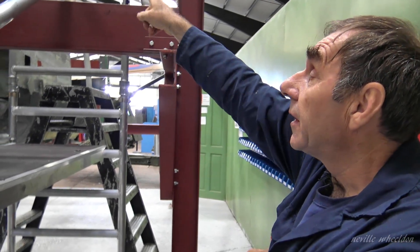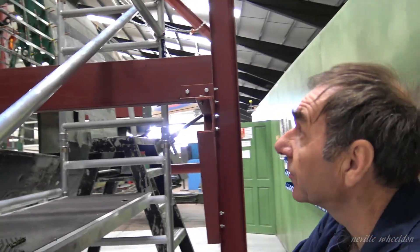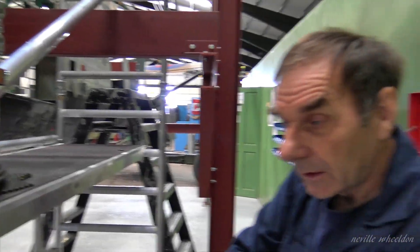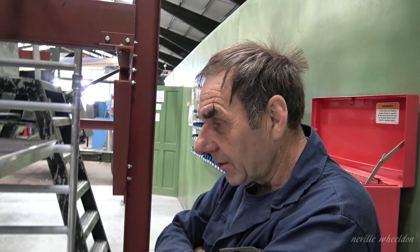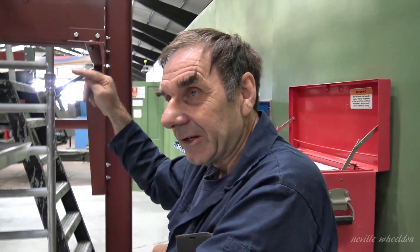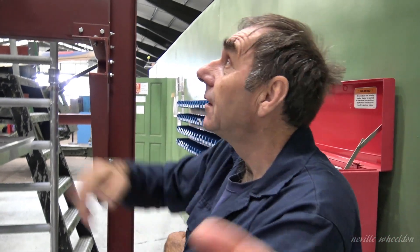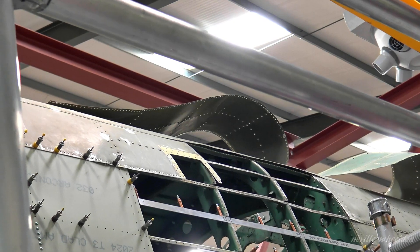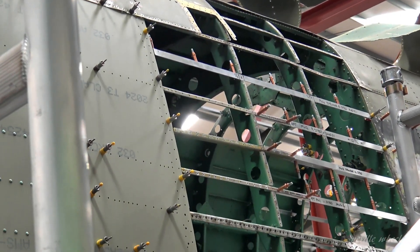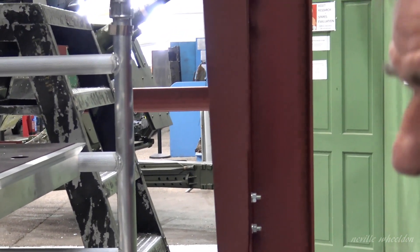The skin on this seems to be progressing. Is Phil making that piece he took off at the top? Yes, Phil's making the thin one at the top — it's got that cutout where the exhaust for the APU came out. What sort of APU did it have? It's a petrol engine generator. Whereabouts was the generator — where was it sitting? On top of the tail plane. It was fitted during and post-war but only for use on the ground. You can see the little square on that skin — that's where the exhaust came out. It had a little scoop which directed the exhaust, and it was just a small petrol engine generator.